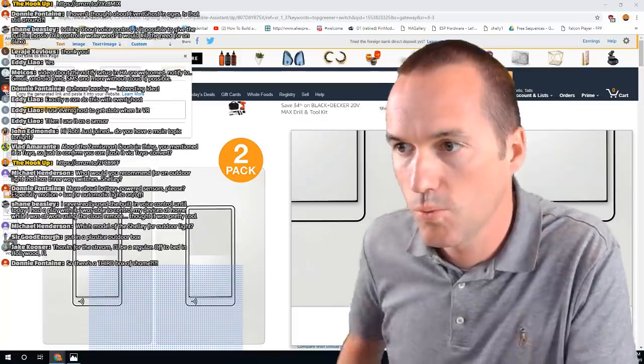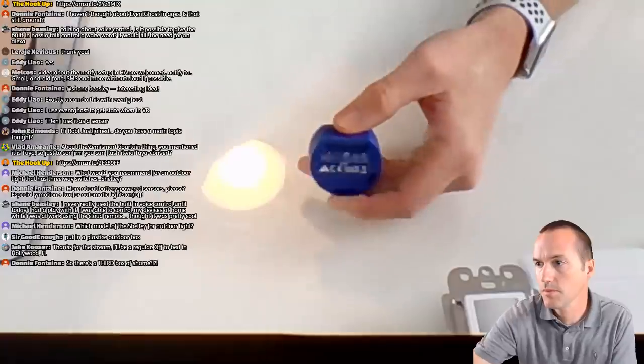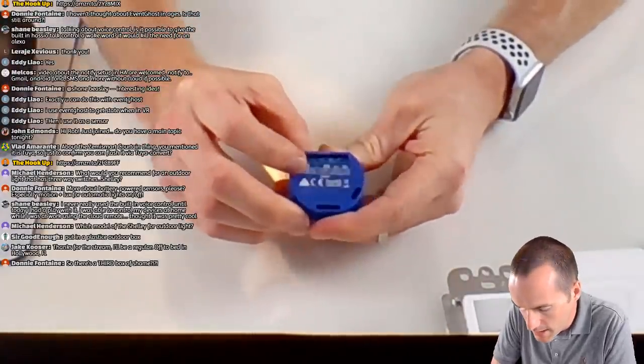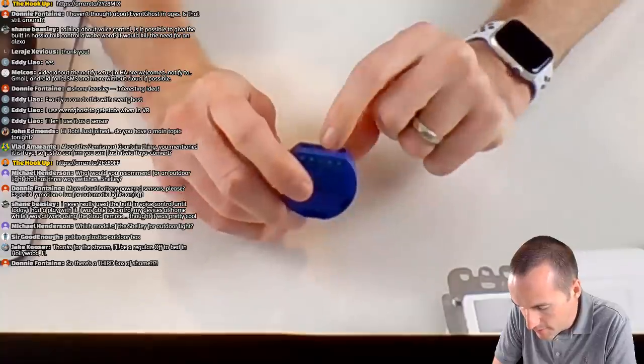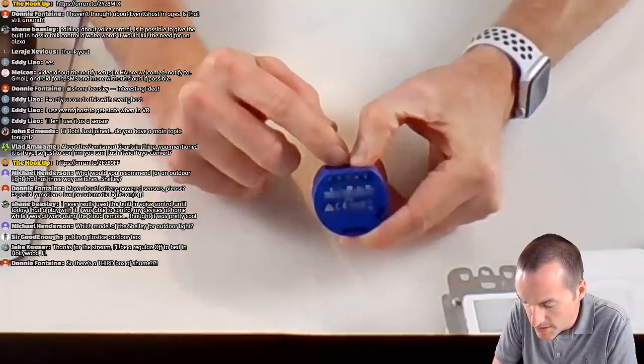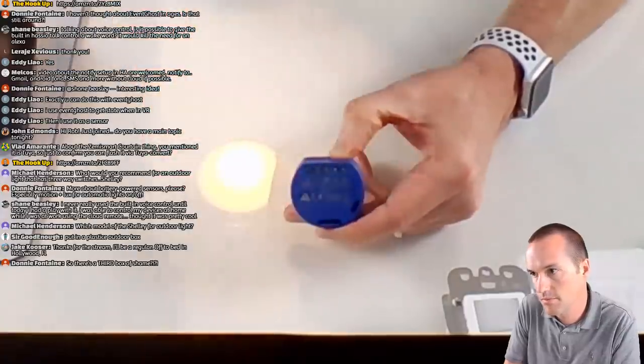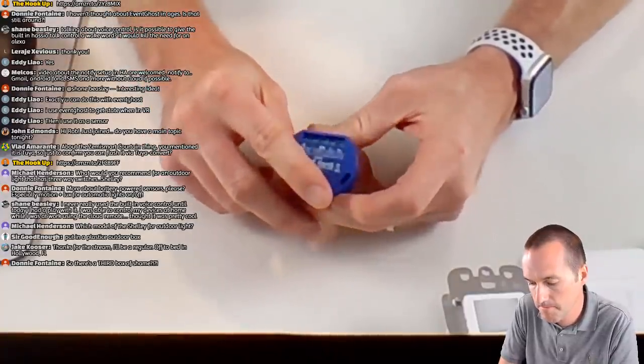The Shelly 1, if you have a three-way switch, which is this thing, has a spot for a live input for the switch, and that's where you hook your traveler into the switch input on here, and that allows it to do its thing.